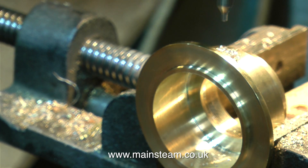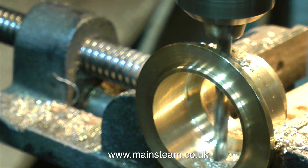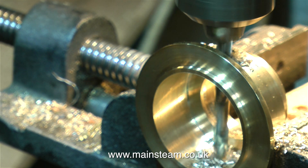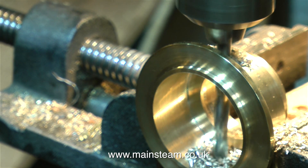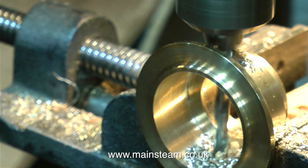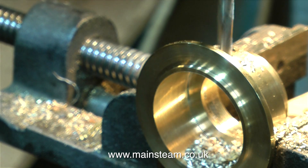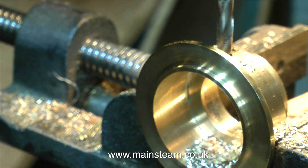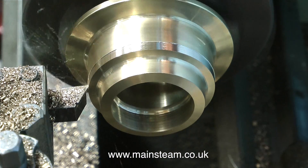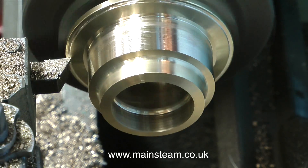When doing this, it's very important to make sure the piece is accurately mounted in the machine vise, because the next operation is to drill through from the top hole to the bottom, and the drill is going to wander very badly if this is not perfectly square. The fittings for the steam inlet and outlet for the super heater are going to be 5/16 by 32 threads per inch, so I need a 5/16 inch diameter hole, but I'm using a quarter inch drill first — then if there are any errors, I can use a file to correct them before drilling to the final size. I need to keep the weight down, so I'm losing metal wherever I can, and I also need to machine the flange perfectly flat.